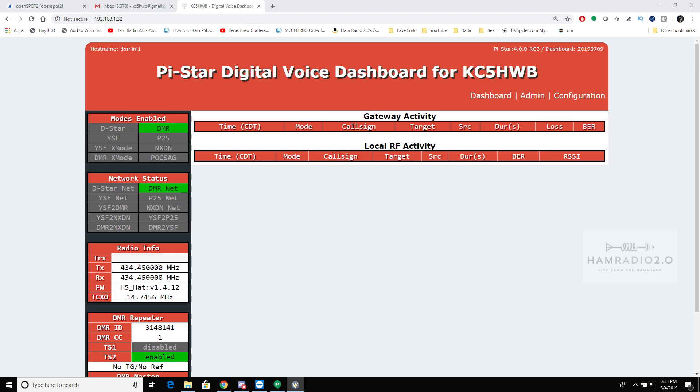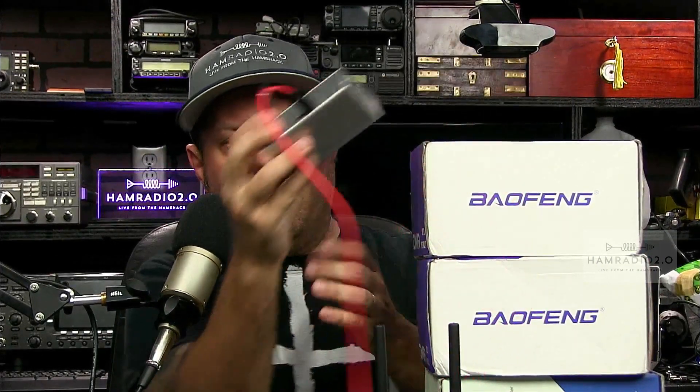I don't want both of these connected at the same time. If you've ever listened to TAC 310 before they made changes on Brandmeister — have you ever heard a bunch of people key up, throw up their call sign or ask a question, and then it would loop over and over again? That comes from someone having two hotspots on the same frequency online at the same time. So be careful. You can have two hotspots, just put them on different frequencies. Or in Pi-Star you can change color codes — have one for DMR on one network and one for DMR on another, on the same frequency with different color codes, so they won't interfere with each other.